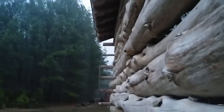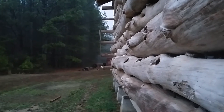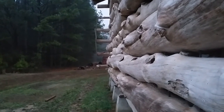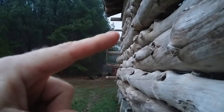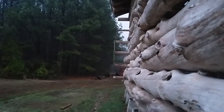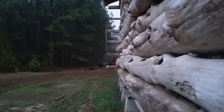We're gonna start putting the porch on, at least on the west side and also the east side, because these overhangs are about four feet which is fine for a one-story house — I knew that when we designed it. As part of the design I added a porch too. It'll be a ten-foot wide porch, it'll come out and protect these lower logs, and the upper roof will protect the upper logs. So we'll just keep going and that's where we're at.